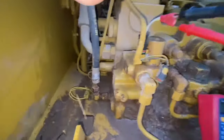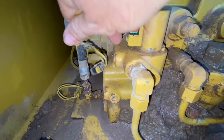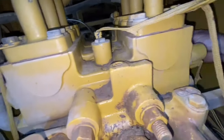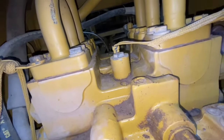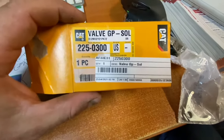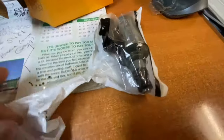There's something wrong with this solenoid, and that'll be what's causing the high current draw — if it's got low impedance, it'll just be burning the power. Also, when I pulled the plug to the solenoid out, the CAT display came up with fault 358-5, low current draw, so we know our ECM is working properly.